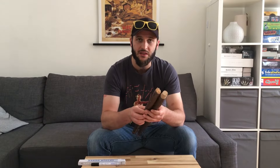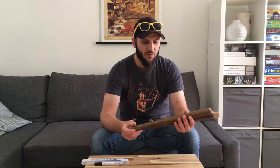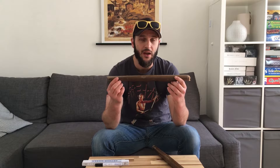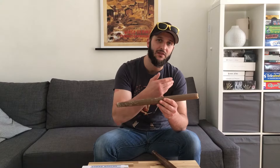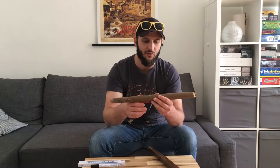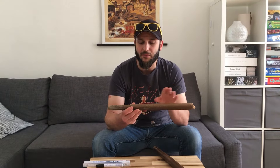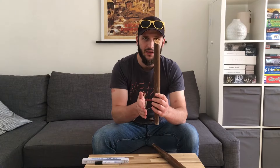There are some scrapes and some uneven cuts I'm going to have to work with, but if you're going to get any kind of recycled wood and repurpose it, the best thing you want to do is make sure that you make all your cuts clean - you have control over those things. Take a look at the piece of wood that you have and make any decisions now based on the appearance of the wood. If there are any gouges, knots, uneven areas, or warping, take a little bit of extra time to find exactly where you want your wood.